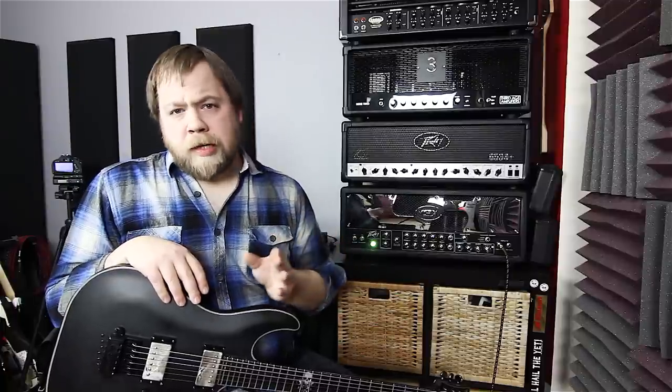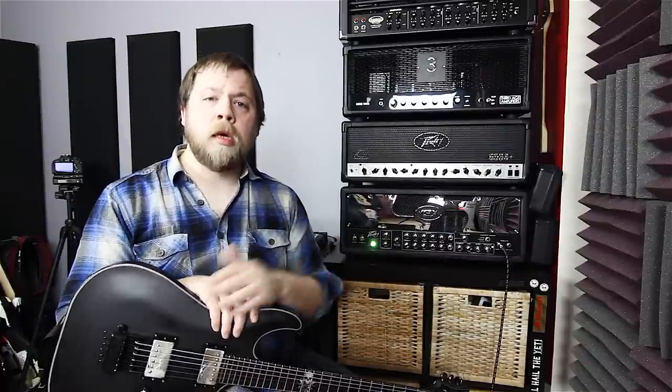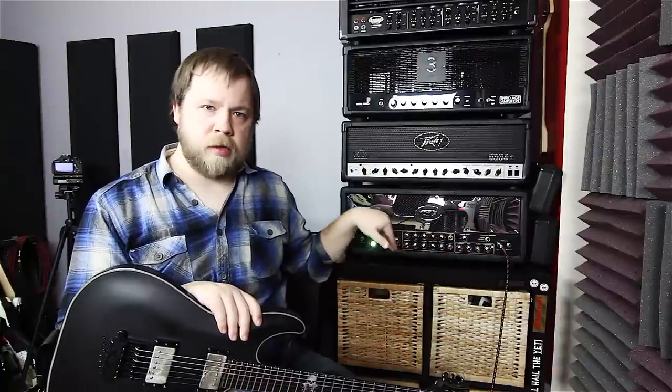Another tip, if you have one of these JSXs and think it sounds and feels a little thin, I thought this amp was very, very thin when I first got it. It had the stock preamp tubes, which were all Shuguang Chinese preamp tubes. A little tip for you: put all Ruby JJ preamp tubes in the preamp section. All the same tube, all of them in the entire thing. It just makes this thing a fire-breathing beast, and I love it.